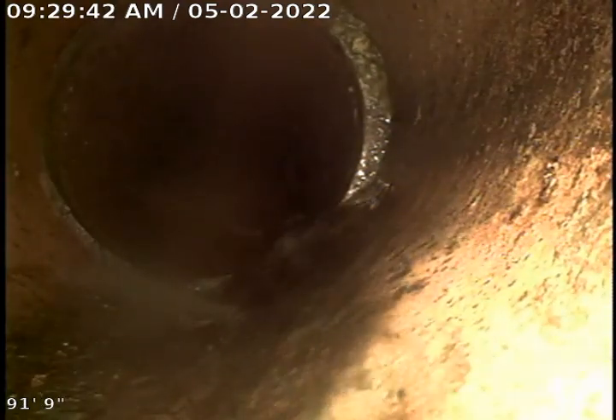We're pulling back from the city sewer back into the customer's private main. It's clay tile throughout — older home. The minor offsets you see are typical for clay tile. We can see some loose roots we cut there, and more coming back. You can see the root intrusions were severe.